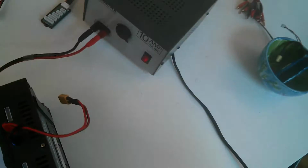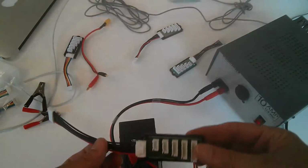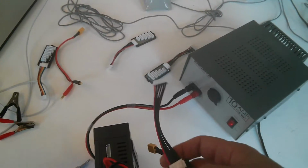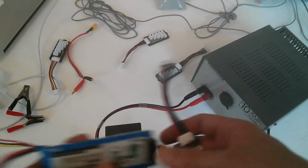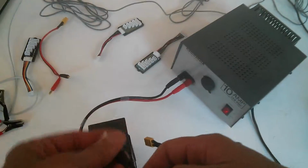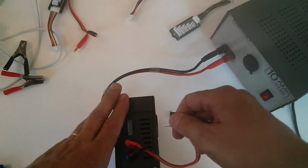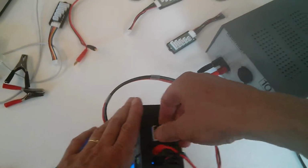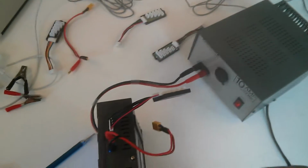And the other thing you're going to add is this board, which allows the charger to charge the cells. There are 2 cells in this battery pack individually, and that turns out to be a higher quality situation. It allows the charger to pay attention to what's going on, and it's kind of industry practice right now. That's how everything works. So we charge individually.